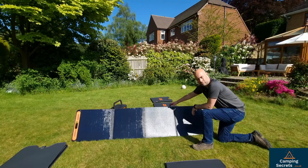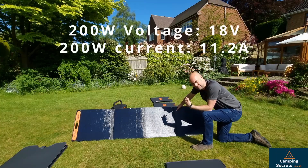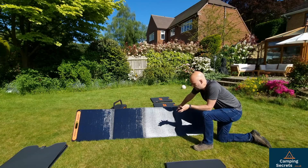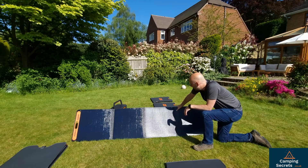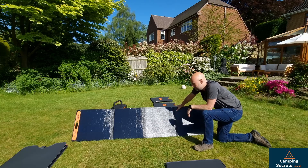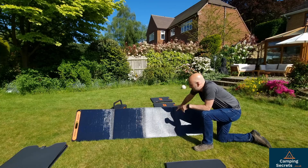In terms of voltage, these give around 18 volts each. If you put them in series you increase that voltage — with two in series it'll be 36 volts, and then three gives up to 54 volts. There's around 11 amps of current under full conditions, and the open circuit voltage is around 23 volts.